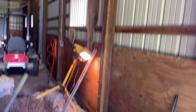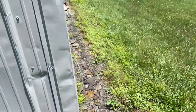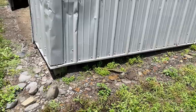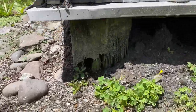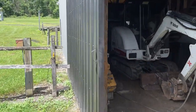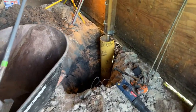Anyway, we had some of our posts here that have rotted out because there are no gutters on the outside of this side of the barn. Over time - a long time, I don't know how many years because it was here before we came to the property - the rain has come off and washed away, and you can see it's exposed. Because it's exposed, it has gotten moisture, air, wet, dry, snow, everything. This side of the barn is affected while the other side is perfectly fine because they're totally covered. So we're replacing these things.